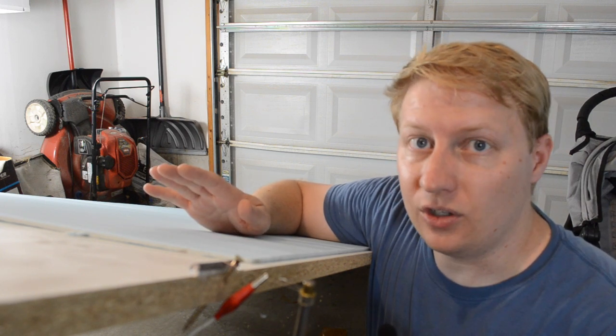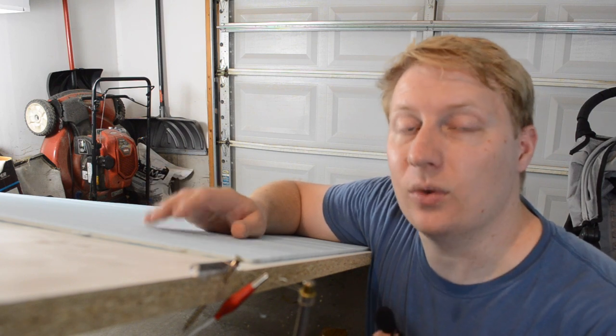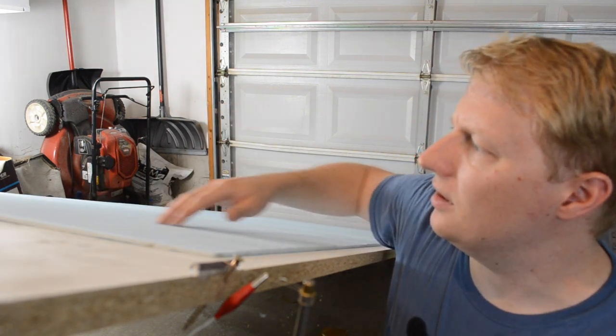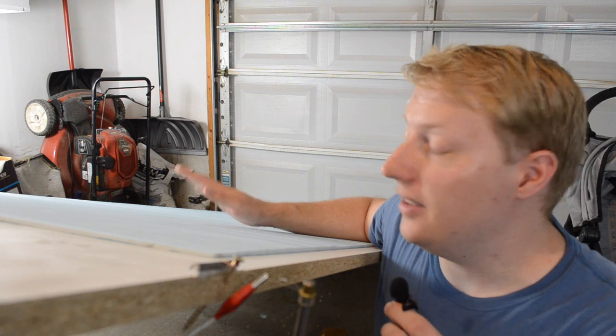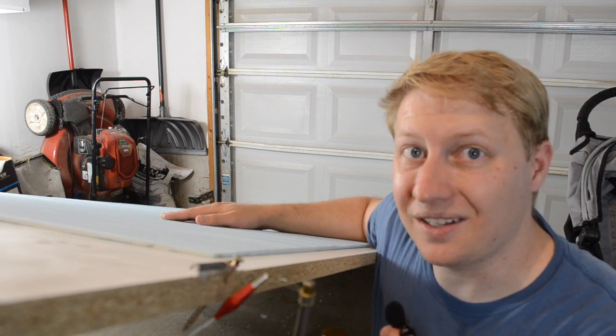So I then went to a larger power supply to put more heat into this thing, and that was the ticket. So this is my first cut, beautiful quarter inch sheet. Got a couple of little teeny undulations in here. It's not too bad. I might turn up the heat just a little bit more, but this is a usable result. So we're gonna run with this and better go cut some more foam.